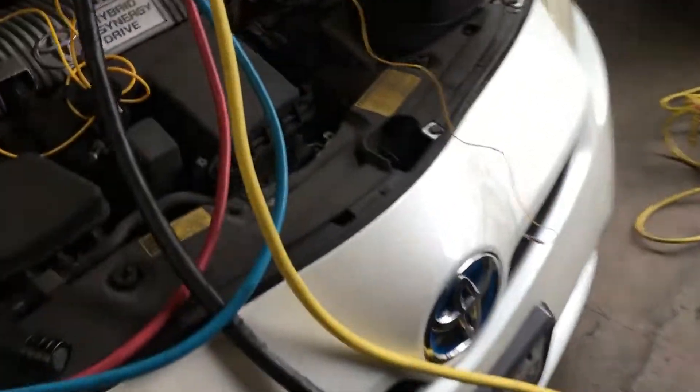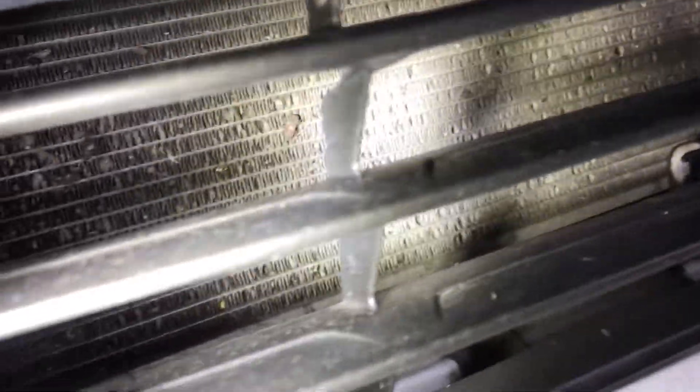Get down to the compressor when you can, which is not always easy, but on this one it was really obvious. I grabbed the wrong flashlight — I'm using a black light instead. Let's see if you can see it. There we go — look at all that oil right there at that fitting. There's the dry part of the condenser, and as you come this way you see it turn dark, and where the oil was it collects dust — so that one's leaking at the condenser.